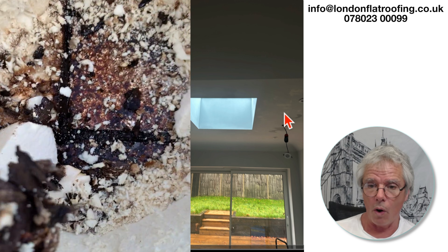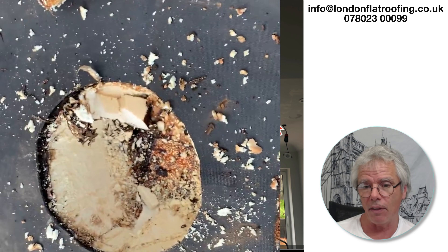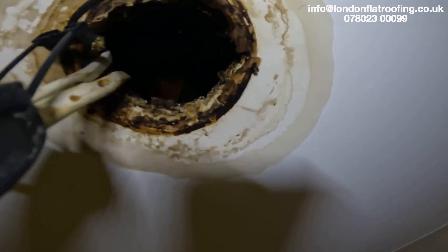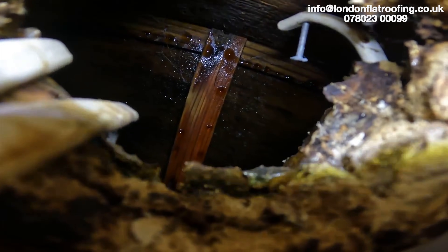This customer has got big problems depending on what's found. The idea is to find out why it's leaking, what the construction is, and whether it's been done well. I've been down this path so many times — a lot of money has been spent on this and it's all really bad news. A lot of people will just fix the roof and leave it. It's bad news knowing that possibly the front roof area hasn't been done properly and is letting air in, and this area is going to be wet. But to put all this right, you've literally got to rebuild the whole roof from the outside — and I'm telling you, this is £20,000–£30,000 worth of work to put it right.